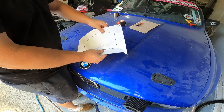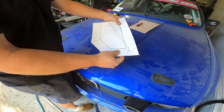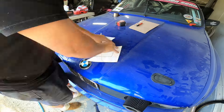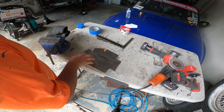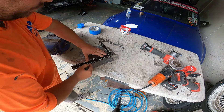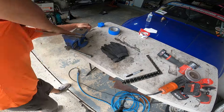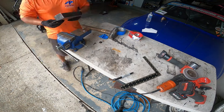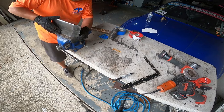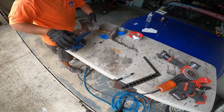All right, so I cut out the shape and cut out all my corners. Now we're going to fold all this up, see where they overlap, and cut it so all the corners will meet up nicely and make a nice box. We've got the piece I need to bend up. We're going to mark up where the bends need to go and clamp it in the vise and just start bending it over. I transferred the paper template onto the metal. Now I need to deal with getting creative and bending this up — it obviously is not a square. This thing put up a hell of a fight, mainly because I don't have a press brake or anything. I had to hammer it, stand on it, and just pull out all the tricks that I had, but we ended up getting it and it turned out looking pretty good.